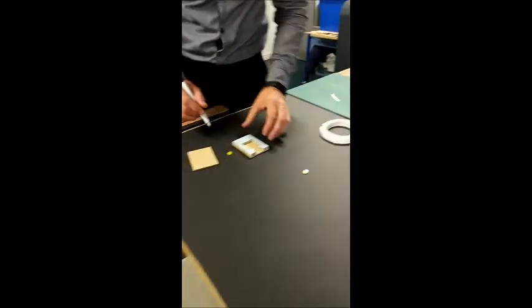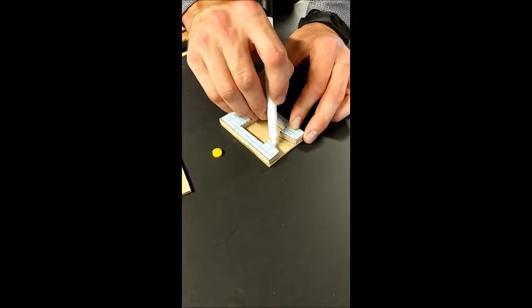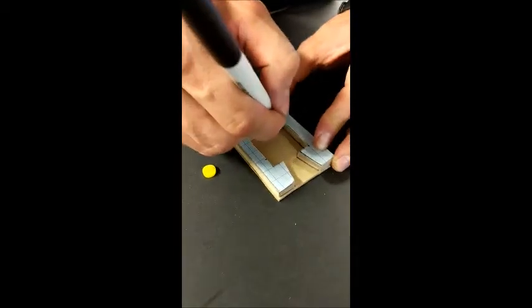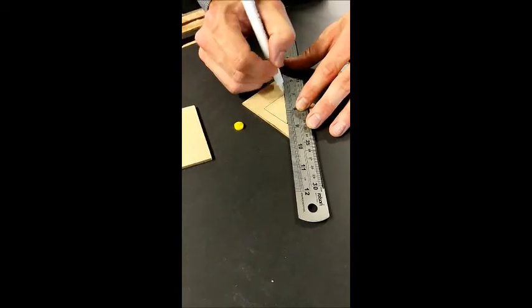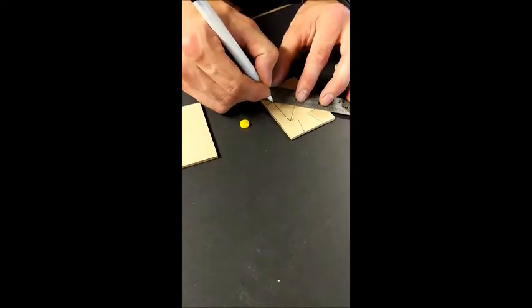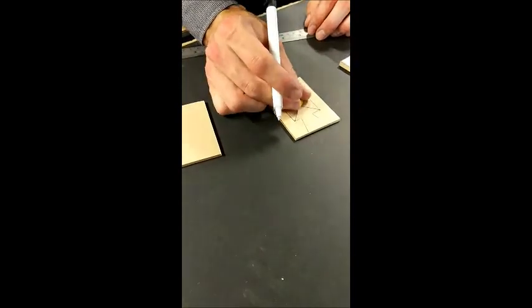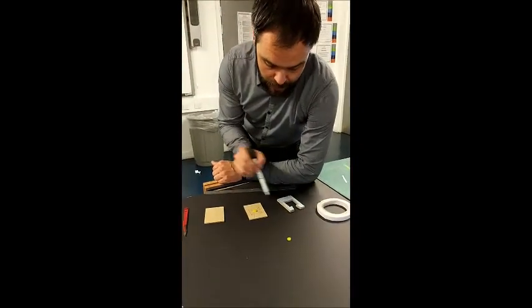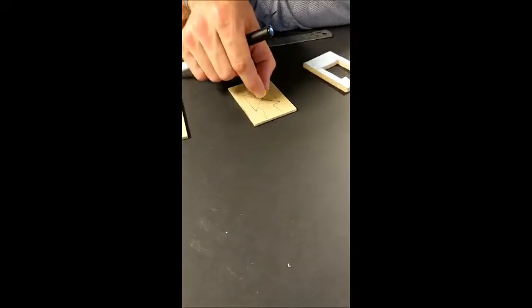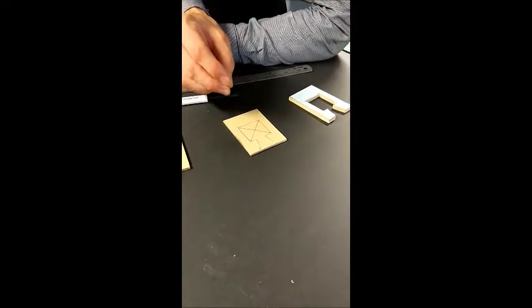The first thing I'm going to do is put this in the centre of my product. I'm going to do this quite roughly — I'll put my template on top of the backing piece of the mould and draw around the outside. That gives me an image of the template. It's not super accurate but it's quite good. I'm also going to put a little cross in to give me a centre point. This is a fairly rough way of doing it. A better approach would be to make a separate paper template with a hole cut out the size of this, so I know exactly where to place it and can guarantee it's completely centred.